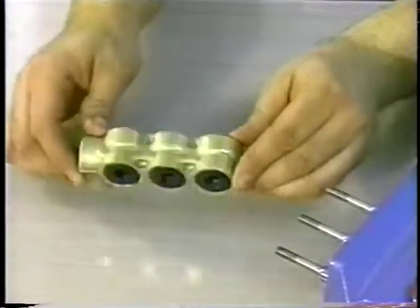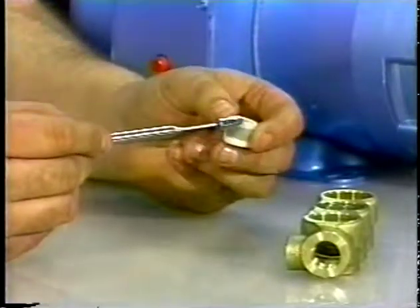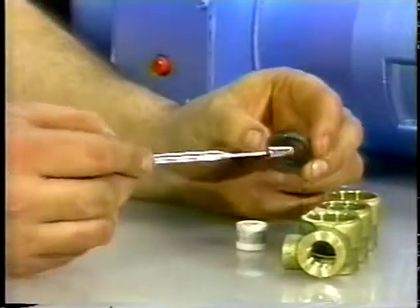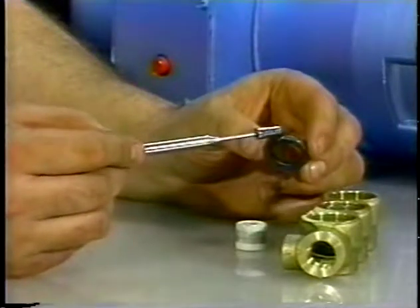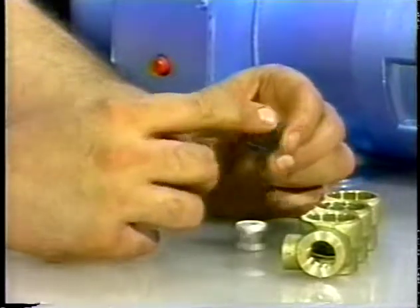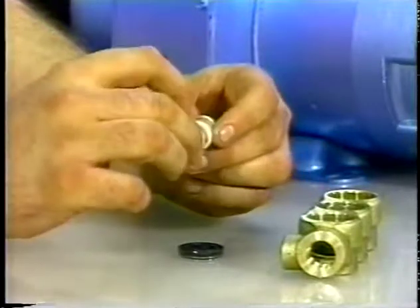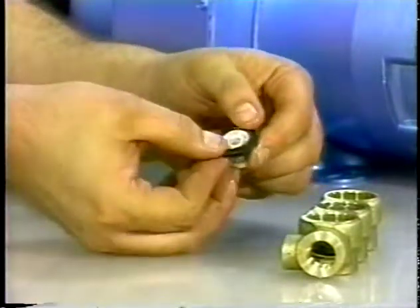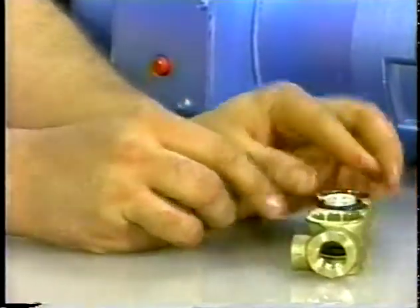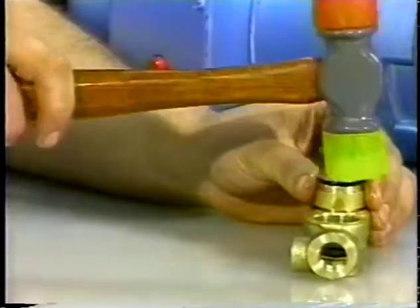Invert the inlet manifold with the crankcase side down. Then examine the ceramic plungers for any scoring, cracks, or chips and replace as needed. Examine the high-pressure seal for wear or damage and replace as needed. Lubricate both the ceramic plunger and the new high-pressure seal. Then insert the deeper recessed side of the plunger into the metal back side of the seal, centering the seal on the plunger. Install the plungers into the inlet manifold chamber with the deeper recessed side up and press into place using the discharge valve adapter.